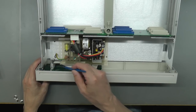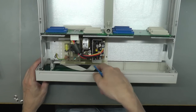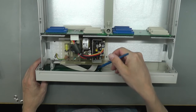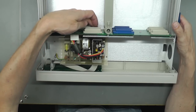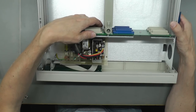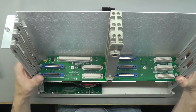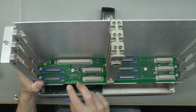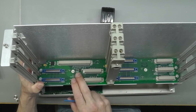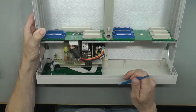And that display board then just interfaces to the back plane via this ribbon cable that you can see here, that just goes away underneath the power supply, then up onto the back of the motherboard there. Let's take a little look at that there. And yeah, that's the solder pins for it there. And you can actually see there are some semiconductors on the back of this motherboard here. That's obviously to do with the power supply switching to control the power.